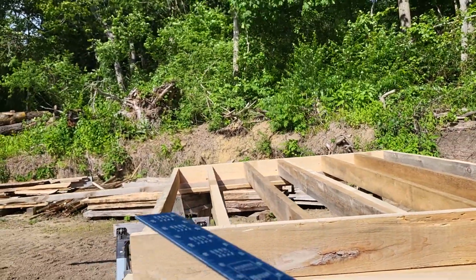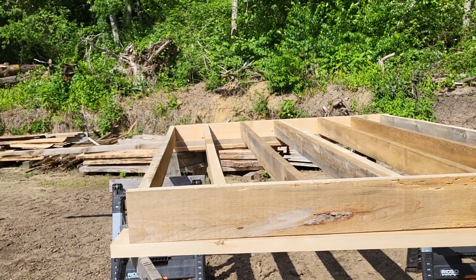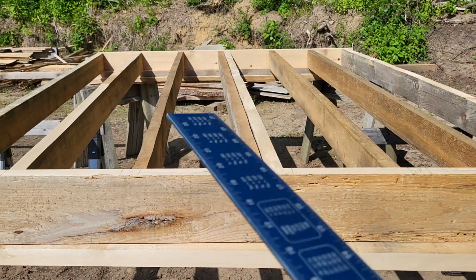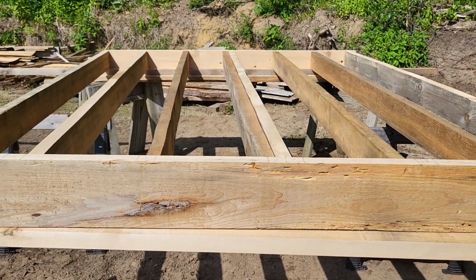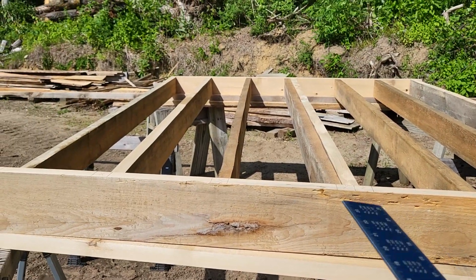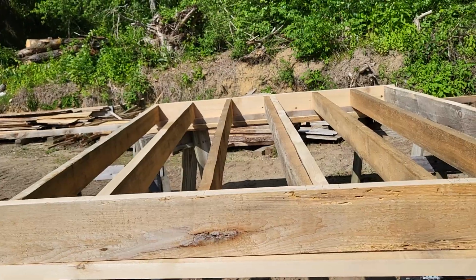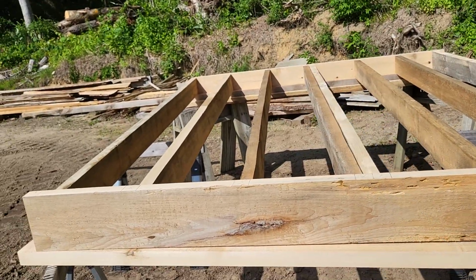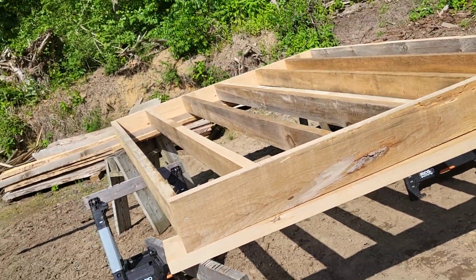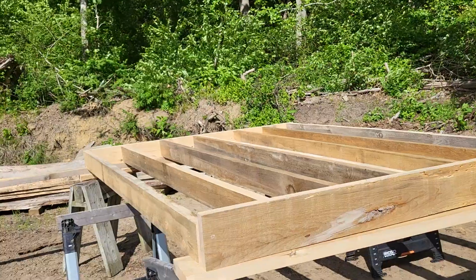The layout came out just right around 14 inches, double in the middle, where the forks are going to come underneath. If you didn't watch video one, watch video one. I took this edge joist in that one, and I transferred the layout, so it's perfectly the same on both of them. I did lay out both sides. I normally don't, but it's just the way that I had to work out the math on getting them even. Like I said, just less than 14 inches on center.